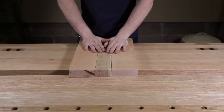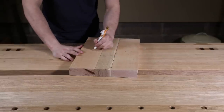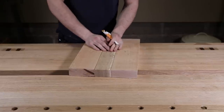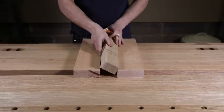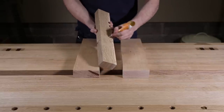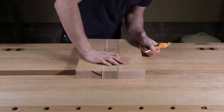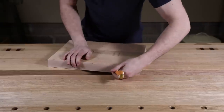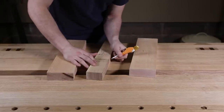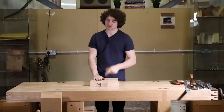So: growth rings down on this one, growth rings up on this one, perfectly straight in the middle, wide grain on the edges, thin grain in the middle — that's the orientation we're going for. Let's mark them up: this is component one, component two, component three. Now we need to mark the face sides and face edges. On the oak, I've changed my mind — I want this side face up because the medullary rays look a little bit prettier, and flattening this side first means I'm less likely to bust through and expose that knot. A little face mark swish on each component and down the edges, and that is it for part one. In the next episode we're going to get all of these components square using nothing but a plane.